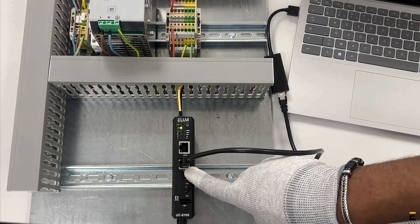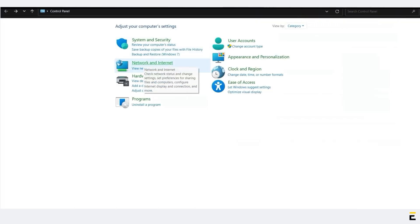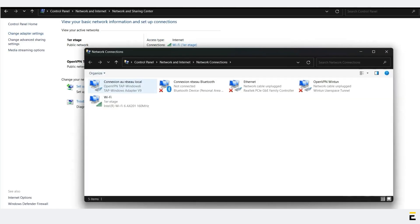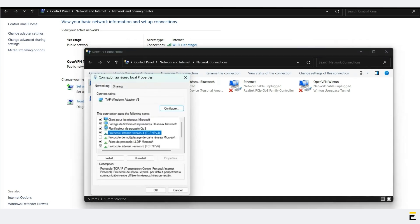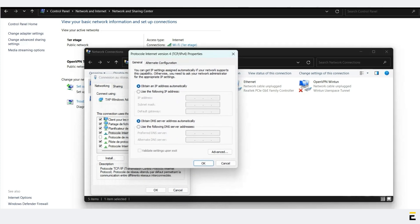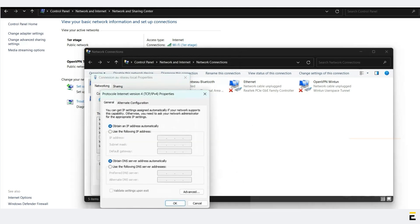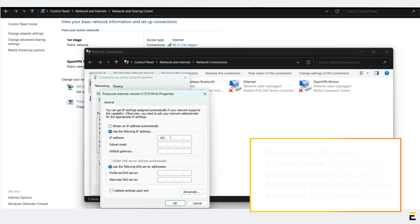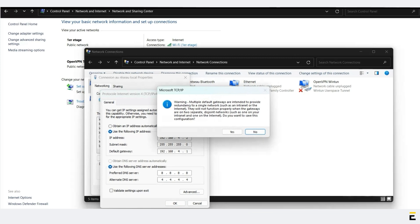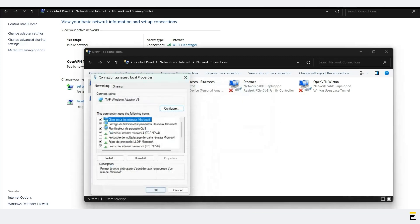Access the settings from your laptop. Go to Network and Internet Settings, then go to Change Adapter Settings. Right-click on the connection to the Local Network and select Properties. Click on Internet Protocol Version 4, then select Properties. Select 'Obtain an IP Address Automatically' to enable automatic IP address allocation, or select 'Use the following IP address' for manual IP address assignment and enter the settings as shown. Click Yes. A small TCP/IP window will appear — click OK to save the configuration.